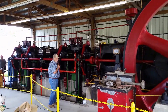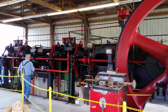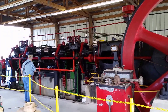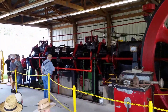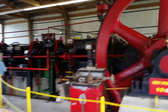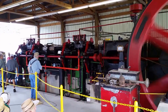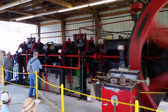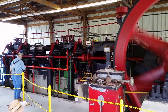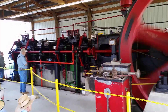This guy is ready here pretty quick. He's going to turn the ignition on and then use the gas. He's going to bring it up partly to pressure, and then start this thing. There's gas in the line, and he's going to disconnect the starting air and start distributing air to each piston in sequence.